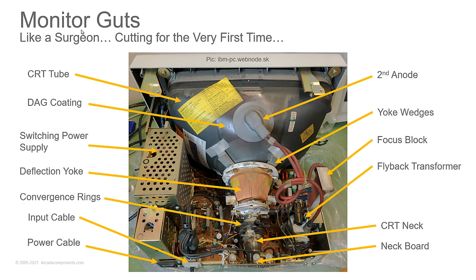every time. Yeah, what'll happen is it will jump to the nearest ground point and you'll hear occasionally a little pop, pop. You turn out the lights and you look and you'll see a little spark going from the edge of the tube down to the circuit board. Very bad thing to have happen. So that's why they have this coating on here.